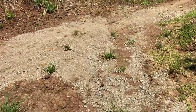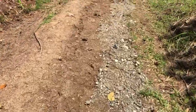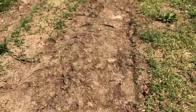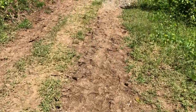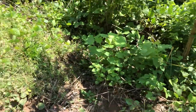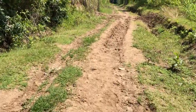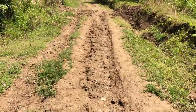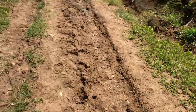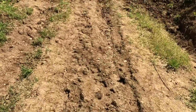And we're aiming to get the same type of thing all the way up. There are a few sections where it has been quite muddy and we filled it with gravel just to try to minimize the damage. It dries out very quickly — it's been basically two days now without rain and it's drying out well. This is the section I'm worried about. And here's our next one up here. My strategy is to get as much water as I can off from going into that there, which potentially could cut the road off. And here we'll put a bit more gravel. Pretty much this is drivable easily now in two-wheel drive.